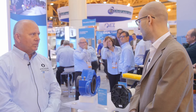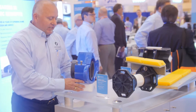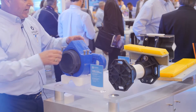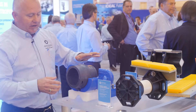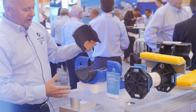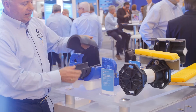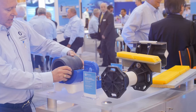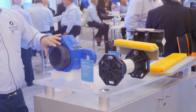Can you tell me a little more about the individual components for these chains? Certainly. This, for instance, is our wall bearing for the head shaft, the live shaft, where the shaft will be spinning inside here. Many of them are split cap bearings, but now we have this hub that is also split. So you are able to remove the bearing by just lifting up, take the top off, lift the shaft up a little bit, sneak this out, sneak it back in. It's safety concerns with the installed maintenance people. Just snap the new one in, drop the shaft down, replace this, and no reason to realign the shaft.